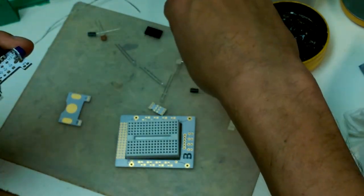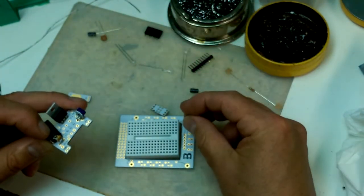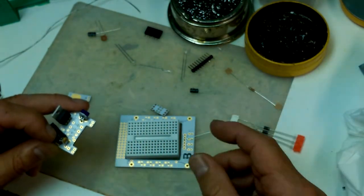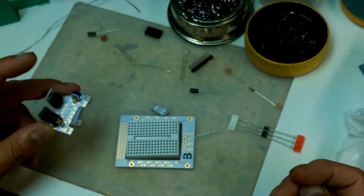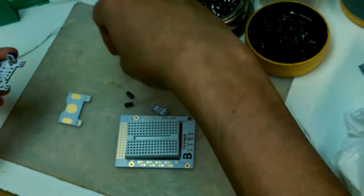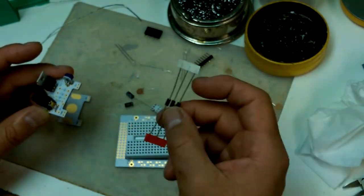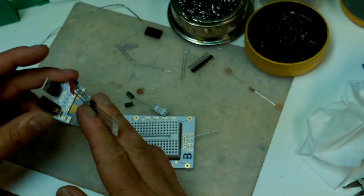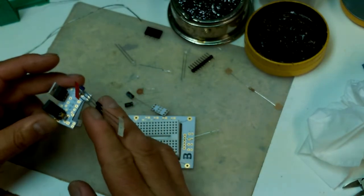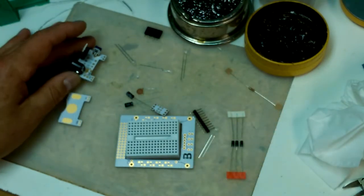So there'll be a fuse, and then you've also got a current limiting resistor and some spots to put some LEDs, so that you can use those as indicator LEDs, and you don't have to take up space here for what you're trying to prototype. So yeah, it's all very nice. A few filter caps for the 317 circuit, and then a reverse polarity protection diode for the rails of the power supply. Some header pins, and that is the kit.